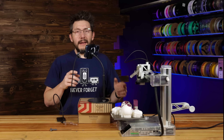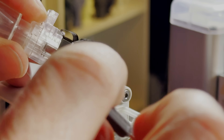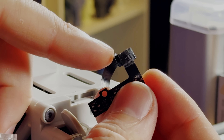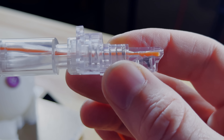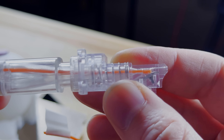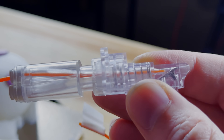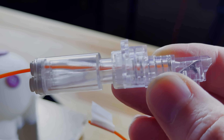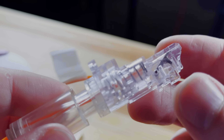Let's take it apart a little further and I'll show you what happened on mine. Remember, we're dealing with really small screws, so don't lose them. This board should just come right off — just like that. There's a little bit of adhesive that holds it, but otherwise we are now free and clear. The problem I was having: filament would go in and print like crazy, but then when it retracted, that silver piece wouldn't pull back all the way, which meant the sensor could still detect the magnet — so even though there was no filament present, it thought there was.